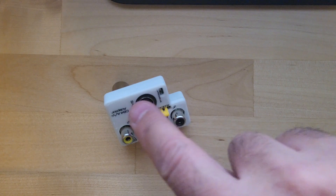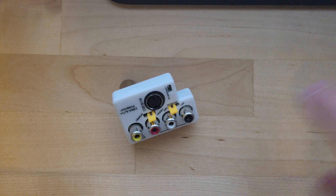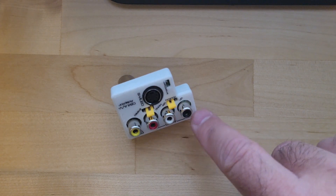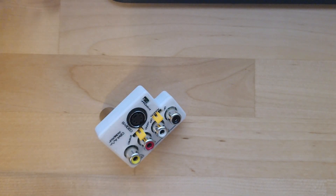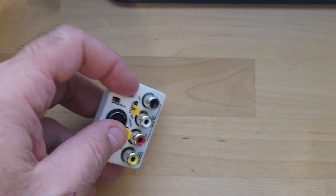The difference is that the five-pin version won't have the S-video output. It'll only have your composite video, your left and right audio, and your audio in. I've very rarely used the audio in. If you have the eight-pin model, you're also going to have your S-video out.